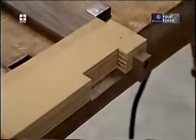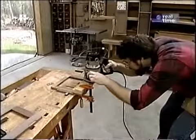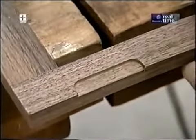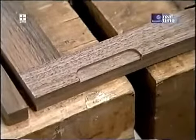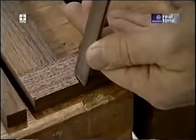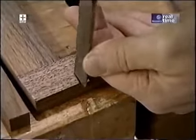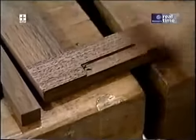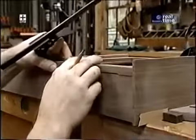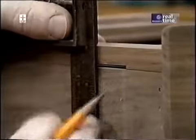I'll do that to both doors and the case. Then I'll square up these mortises before moving on — just use a chisel with mostly hand pressure, pushing down and removing the little corners, so there will be no surprises later. I'm going to mark the mortises on the case using the mortises I've already cut in the doors as a guide.